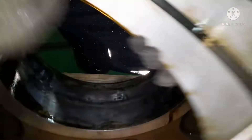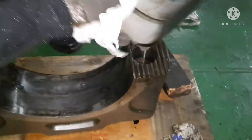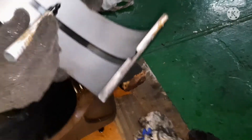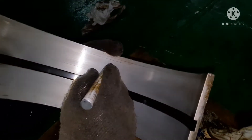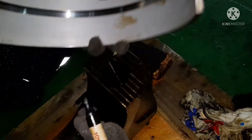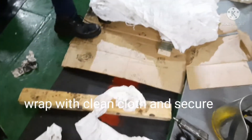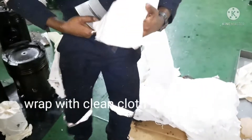The reason you use a wooden pallet is that it does not damage the bearing. This bearing has a very thin coating, so if you use metal it may damage the bearing coating and even the bearing body. This is the number two unit top shell bearing.